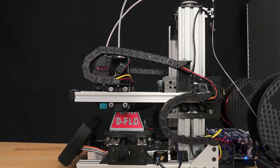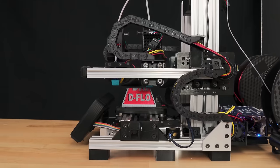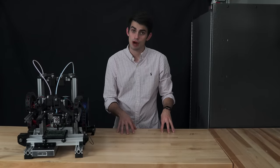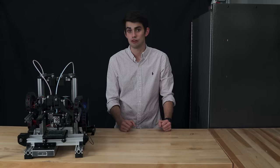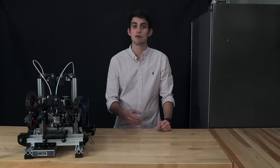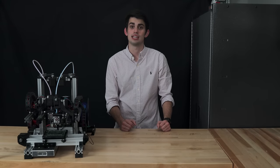One benefit of this design is that the second extruder can be moved out of the way when it is not in use. I can't tell you how many times my dual prints failed on my MakerGear from unwanted oozing of the idle extruder. This ooze would get caught on the part that is being printed, and after cooling, it would obstruct the extruder that is printing, which would often cause the part to get knocked off.